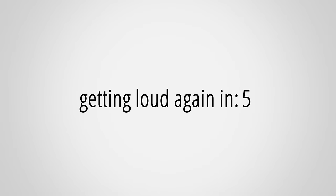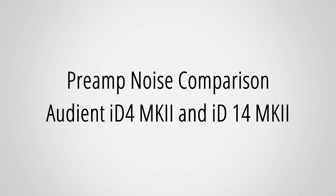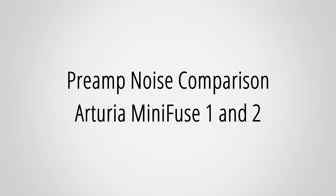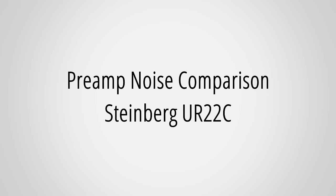It's preamp performance time. I'm talking into a Shure SM7B and letting you listen to the noise floor. The SM7B has a ridiculously low sensitivity, which is a worst case scenario for the preamp. This is a very low noise floor, and this is not surprising as the measured equivalent input noise comes in at minus 129 dBA weighted, which is very low noise. You don't need a Cloudlifter, Fathead, or DM1 with the Volt 276 — the preamps are already low noise enough so that there's little to no benefit in buying such an inline preamp.